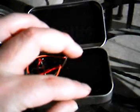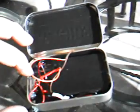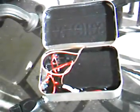Something I've also noticed is that the other builds don't have a blocking diode, so the solar panel will actually discharge your batteries. This is four AAAs in a little case I bought from Radio Shack for maybe five to ten bucks. I have my solar panel and the main power from my battery box going to one end of the switch. This allows the solar panel to charge the batteries, but won't let the batteries go straight to my USB, just in case it's out in the weather or elements.